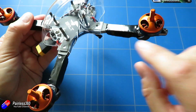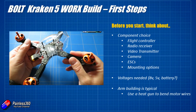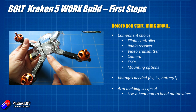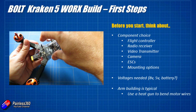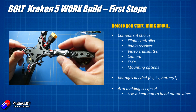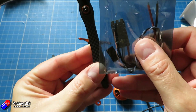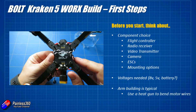For ESCs, I've opted to have them out on the arms. It's better in terms of flipping and rolling to have all the mass as close to the centre of the body as you can, and lots of pilots are running four-in-one ESCs underneath the flight controller, but because of the stack I'm using I probably don't have space for that. You also need to think about ESC thickness because these lovely thin arms really demand ESCs that are as thin as possible, otherwise it's going to spoil the look of the entire frame. I'll put a link in the description to the ESCs I'm using.